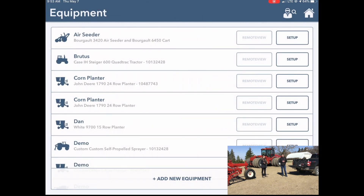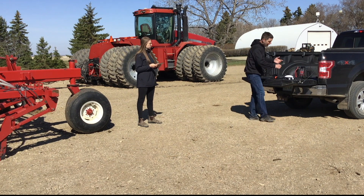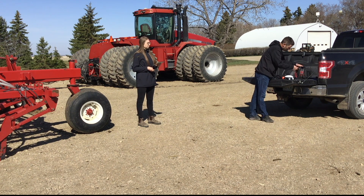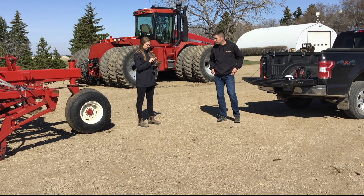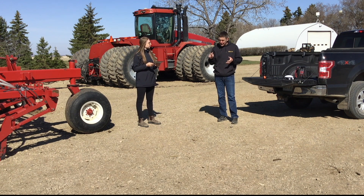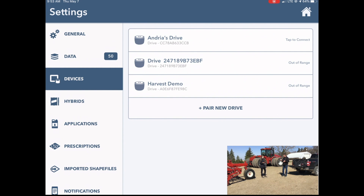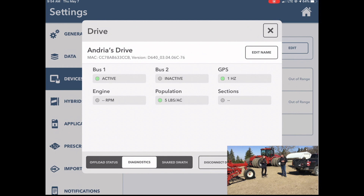I have a seed Application A; I only need to map one fertilizer for today, so I can hit done. Now I have that incompatible seeder set up. Just to check and make sure everything is working, I'm going to hook up a drive really quickly and see if Andrea can connect to it. Let's give it some power — the drive is flashing blue; Andrea should be able to connect to it. To connect to a drive, go to the Settings of your iPad, search for the Bluetooth setting. It's going to ask for a long number — connect to that — then go into the FieldView app, go into Settings > Devices, then tap to connect device.